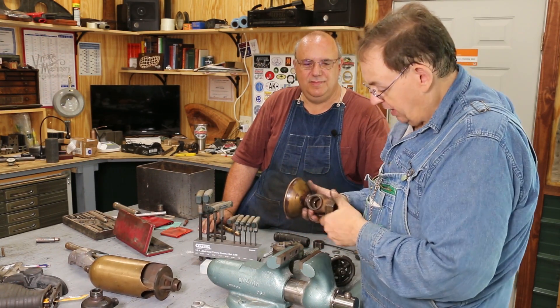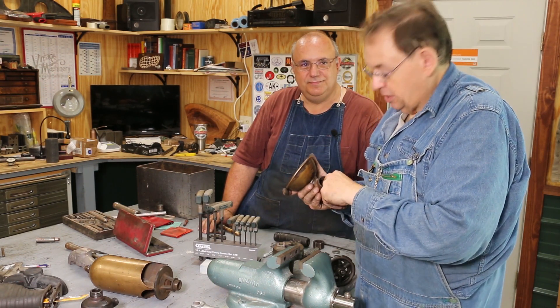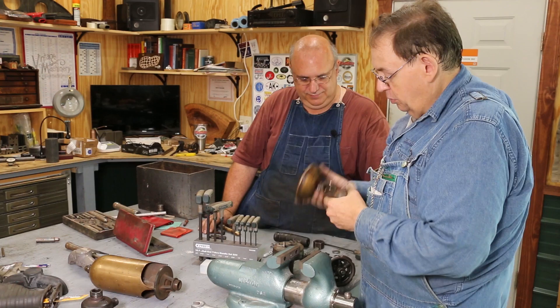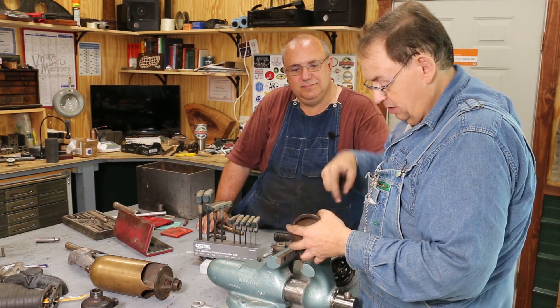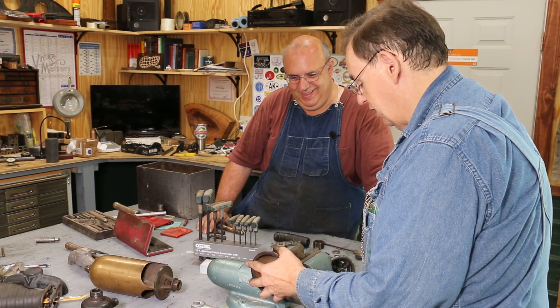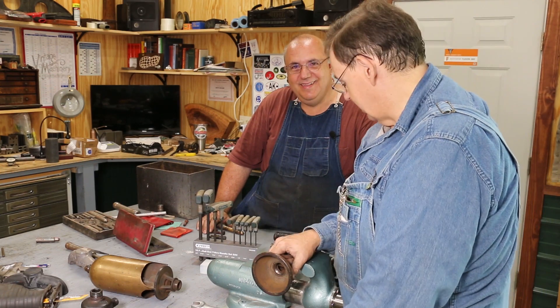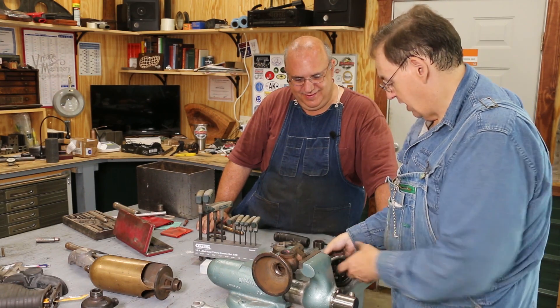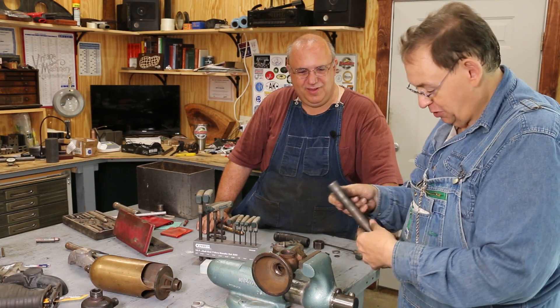So I've got to manufacture a new valve. Part of the problem is the valve seat on the inside of this is cut — steam will cut. So what we had to do was figure a way to make a new seat in it. Keith had this device here and we figured how to make this thing work just right. This is a valve seat grinder or valve seat tool — it's a dresser, or whatever you want to call it.